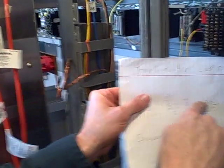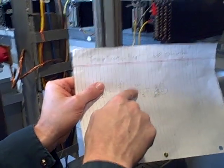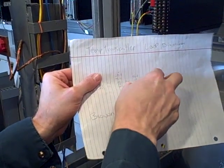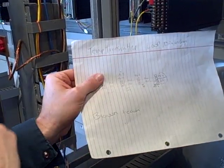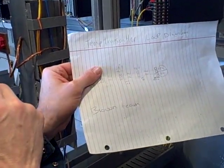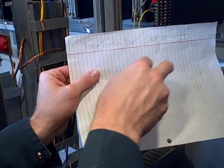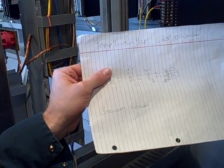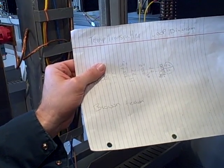If I'm reading right here about 27 volts — positive there, negative there — and over here it's 40-something, negative on 17, positive on 18. Clearly, these two sets of points are not common to each other. We don't have a common connection. They ought to be in parallel — the voltage here ought to be exactly the same as the voltage there. But they're not, therefore they're not in parallel even though they should be. So put the pieces together.